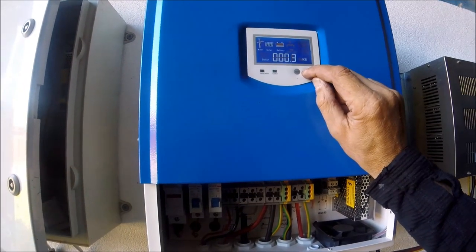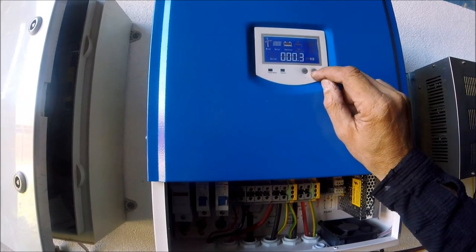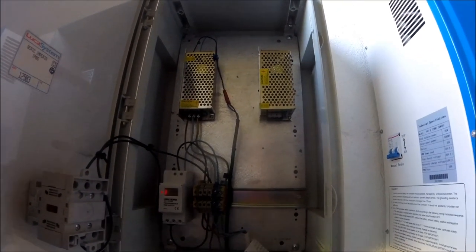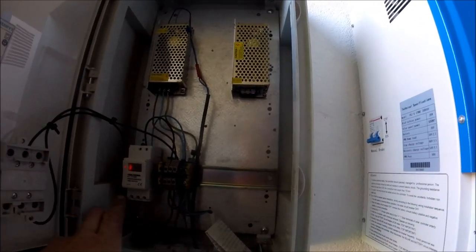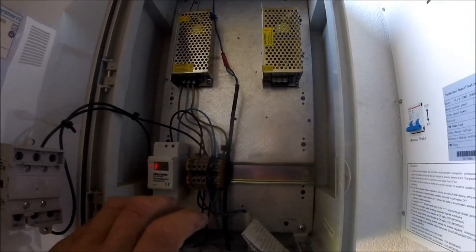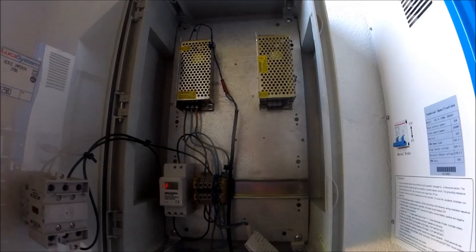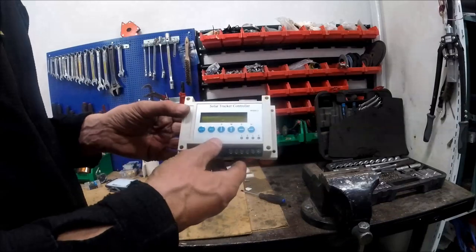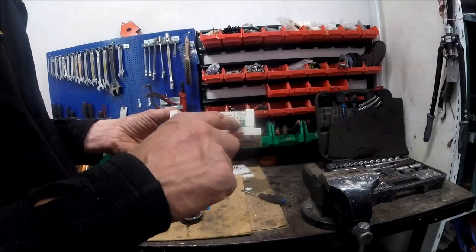Okay, it's working fine. Now I'm going to start up the sun tracker as well. This is the power supply for the sun tracker system — just a 12V DC transformer from 220V AC. I have to put on a programmable switch because these sun tracker control boxes outside are not the best quality — I burned some of them in the beginning. Here you can see the control unit for the solar tracker. It's quite simple — 12 volt DC.